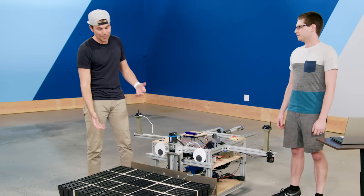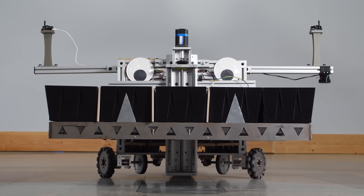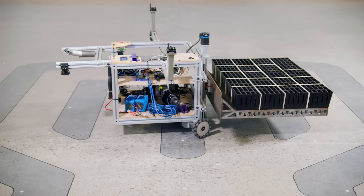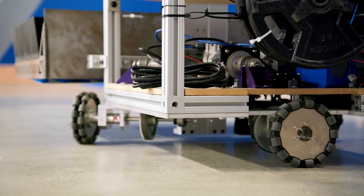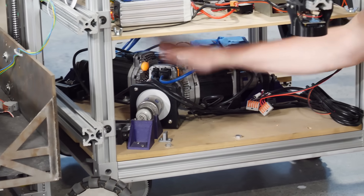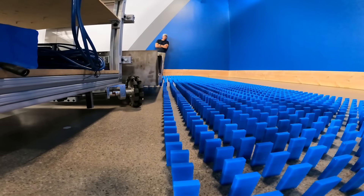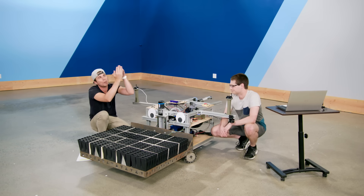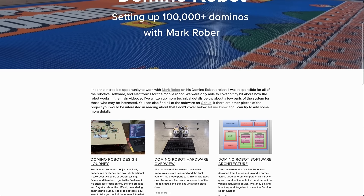The vision from the beginning was that we could set Dom up, turn off the lights and leave, and come back the next morning to find a full field of dominoes — working all night in the dark just fine. Now, how about these super cool Omni wheels? They're awesome because they let you translate in any direction you want — way better than a car where you'd need a five-point turn. With these you can move any direction to adjust for small corrections in domino placement. They're powered by ClearPath brushless DC servo motors — the gold standard in speed and accuracy — allowing us to slide the robot by even just a couple millimeters at a time. Dom's brain is over 14,000 lines of code, all written from scratch. If you want to go way deeper into the technical details, I'll put a link in the description where Alex put it all in one spot.